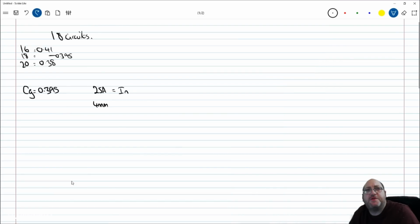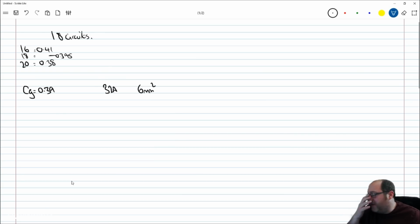Let's assume there's 6 mil on 32. This is still going to prove the point anyway. But let's say they're 32 amp radials, 6 mil, and there's no diversity. There's no consideration of one being on or the other because they're going to individual rooms, individual fuse boards, and individual rooms. So the In is 32 amp.